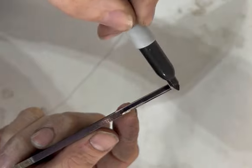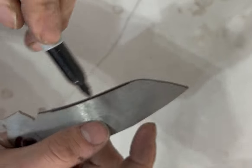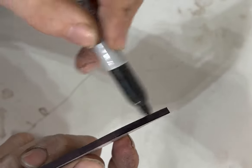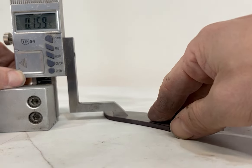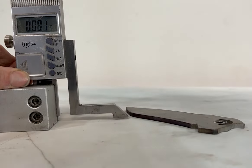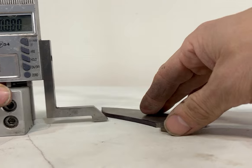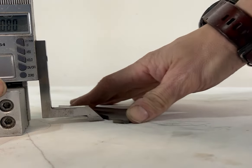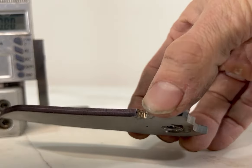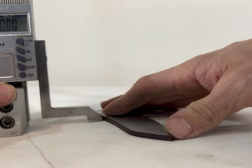The next thing we're going to do is grind the blade, and I think this is the most skill-intensive part of the whole build. It just takes a lot of feel, and it's taken me a lot of hours of practice and a lot of ruined knives to get to this point. Make sure you do it on a cheap piece of steel before you start grinding Damascus. Right now we're just marking the edges with Sharpie so that when we scribe these center lines we'll be able to see where those lines are. We then take it to this flat piece of countertop and measure the thickness with the height gauge, divide that thickness in half, and run that edge scribe along the front of the blade while it's on that flat surface, and this will perfectly mark the center. You don't have to get it exactly in the center because we're going to flip it over and do the other side — sometimes when they're not in the center it gives you a better idea because you have two small lines right next to each other. You can kind of see there where that line shines up, and we're going to use that for our reference as we grind the sides in flat and flush.